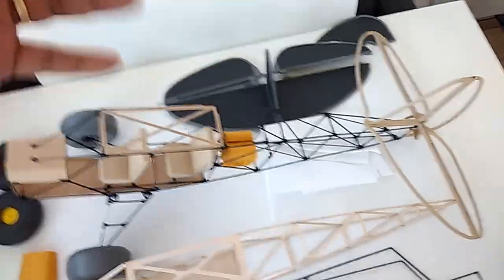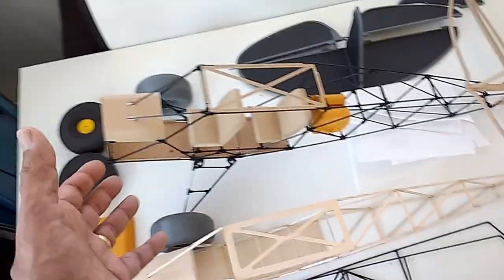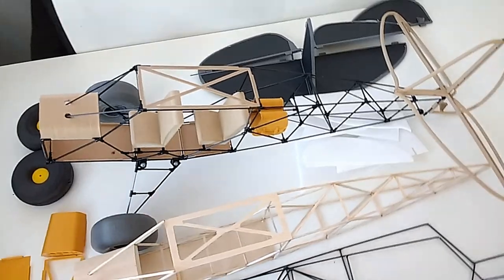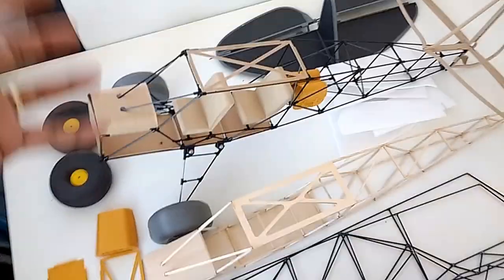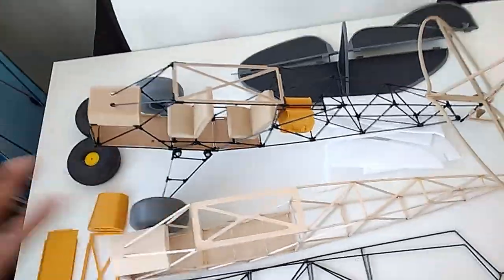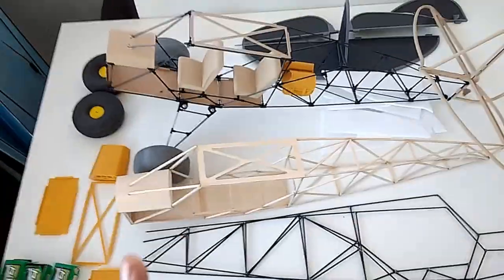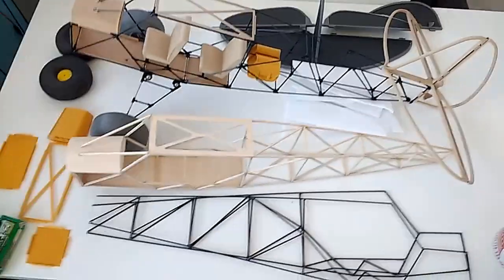I don't like to use brute power. In a true ultralight you should be able to fly a model with a two-cell. My small ones — plenty of videos show they all fly on one cell. They do have a gear motor to swing a bigger propeller, and this can also work in similar ways with a gear system, which I have employed in my larger quarter-scale aircraft. Or you can go direct with a brushless motor, provided it's a low KV and high torque motor, so that you can swing a bigger propeller without the motor ceasing during operation.